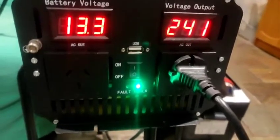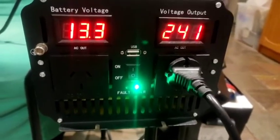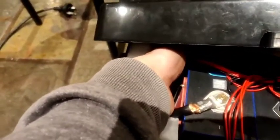We've boiled four kettles, had the microwave on for three minutes, and had the induction cooktop on for about three minutes boiling water. Fantastic — working very well. The BMS of course — temperature-wise, it's around 45 to 50 degrees, same as when we were boiling the kettle. That was just over 200 amps; this exercise was just under 200 amps.